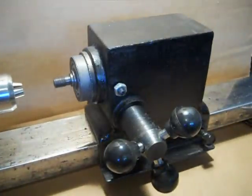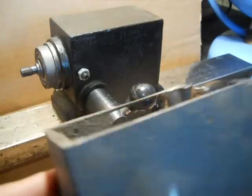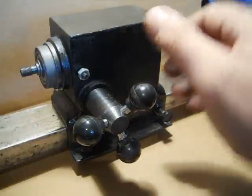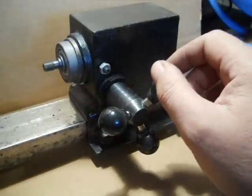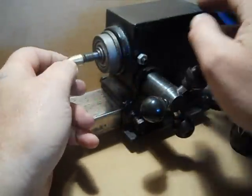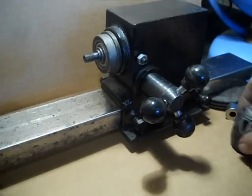This was the part of the drill that was mounted vertically — it would have been like this, then flipped this way. It's all sawed off this big hunk. There's where it went on the pipe — the actual pipe that stands above your stand. I had to make another shaft for this too because the shaft was shot. This is out of a cordless drill. I made a shaft, and there were little collars in there that allowed me to use these same roller bearings. I have a choice of this little piece I made for wood, which is made from the screw that holds your chuck on — you can stick it in some wood. It has four sides to it — I call it flatted. Or you can screw the drill chuck on.